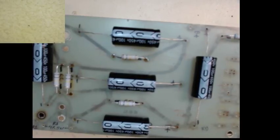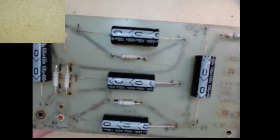But what I'd like to do, even if the board was completed today, I wouldn't test it. What I'd like to do before first power on is to let it sit a few days and try and forget about it. Then come back, double check the schematic, which I'll have, and make sure everything's okay before applying power. So that's it for me for now.